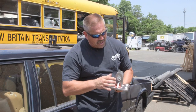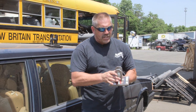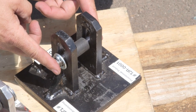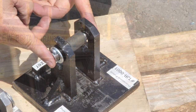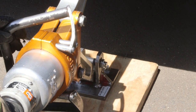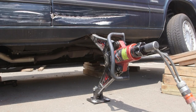As you can see here, the towers are slotted — one and a half inches — and they have a five-eighths inch roll pin that runs between them. The pin is designed to travel. The bottom jaw, when it makes contact with this pin, will push the pin upward. When the pin reaches the top of the towers, you will stop your lift. At that point, you will have your spreaders approximately seventy percent open.